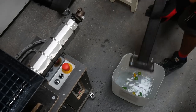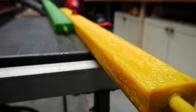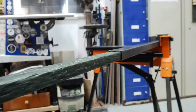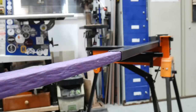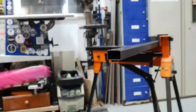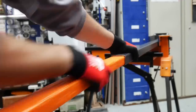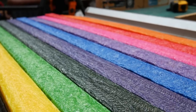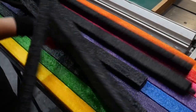We found it helpful to cool the end of the mould in water just for a few seconds to help the end solidify, before leaving it to cool on the side for about 15 minutes. And then it's just a case of rinse and repeat until we've got beams for every colour we need. Safe to say we are in love with these super bright colours. We didn't want the base of the pallet to take away from that rainbow top, so for this we just extruded a load of beams in black.